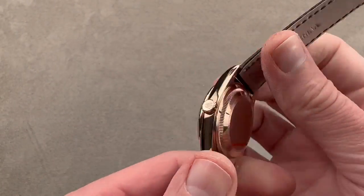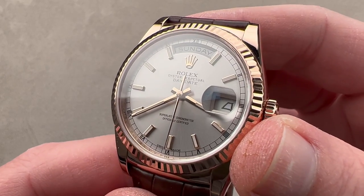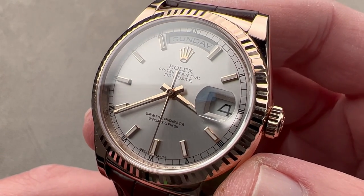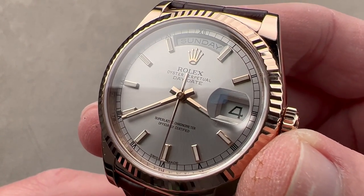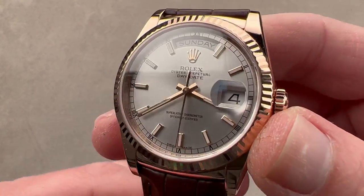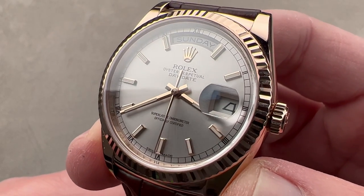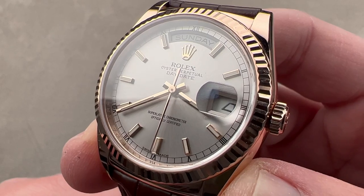Underneath the case back: bi-directional automatic winding, Rolex manufacture caliber 3155, 48-hour power reserve, double quick set with hacking, 4 Hz beat rate, 31 pivot jewels, COSC-certified Swiss chronometer adjusted in five positions. All Rolex watches are adjusted to beat those tolerances as fully assembled watches before leaving the factory — and have been since long before the superlative chronometer standard was implemented in 2015. The movement has a Breguet overcoil hairspring that allows it to keep consistent time in any physical position, with gravity playing less of a role due to the overcoil. The hairspring is made of blue oxidized niobium-zirconium — Rolex calls that Parachrom Blue. It is highly anti-magnetic, and the watch is rendered more shock resistant by a full balance bridge anchored on both sides, and a free-sprung balance with MicroStella adjustment nuts for fine-tuning the timing.